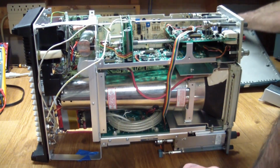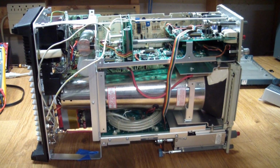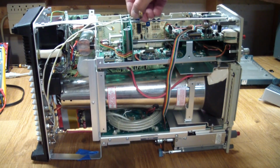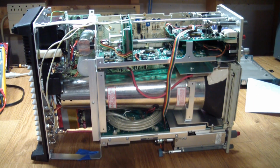So the first problem arose when it basically said, take off the back, and that worked just like the instructions said. Remove a few screws and carefully remove the back, and there's a bunch of connectors threaded through, and you follow the instructions and you won't rip out anything and you'll get the back off. However, to get the bottom off, it told me to remove a certain number of screws. So I had to remove n screws, and n-1 screws removed very easily. But the nth screw was inaccessible. It was basically covered by a shaft coupling of one of the pots running through.